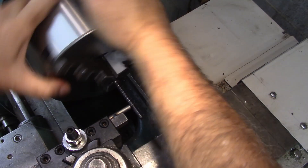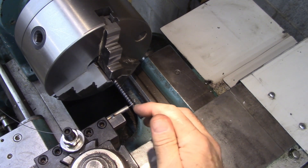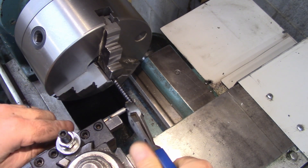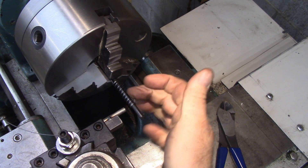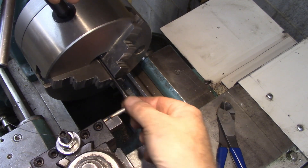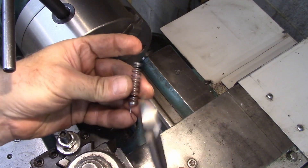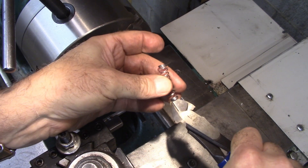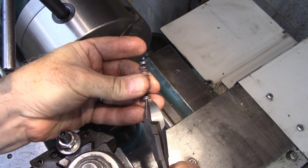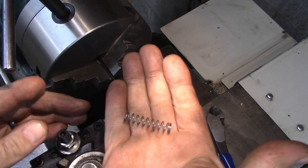When I've finished off the end of my spring I'm just going to back this off a little bit. Take my nippers — and you're going to watch, this spring is going to jump. You can see it's quite a bit bigger now than the mandrel. To get my spring off I've just got to loosen those jaws so I can get that wire out — and there's my spring. I'm just going to take my trimmers and trim these ends off. Watch your eyes when you're doing this. And there's the finished spring.